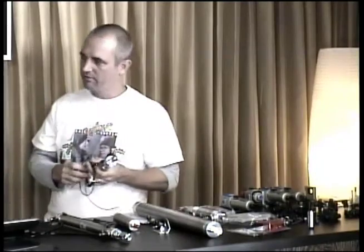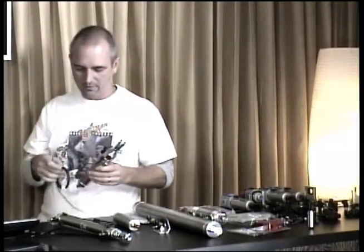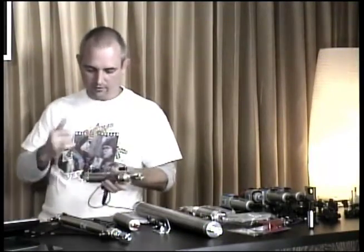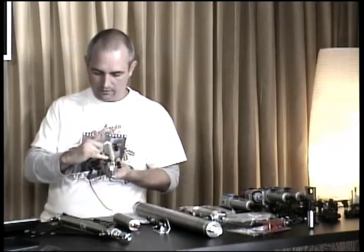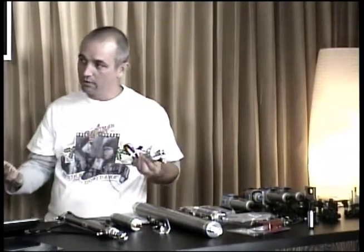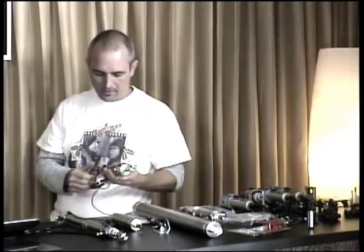Then they came out with Hall effect sensors, and these are solid state. There are no mechanical devices in them, and that's what we sell here. It's going to pick up the magnetic cylinder as it reaches whatever end you've got it mounted on. These that we sell have LED indicators on them. You can mount them on both ends, or on one end, or you might not need one at all, so you can go with either the magnetic or the non-magnetic type cylinders.